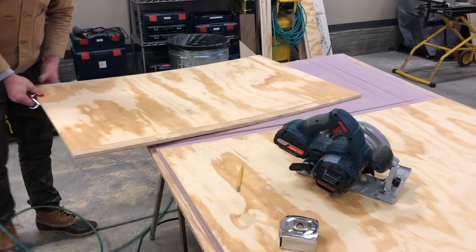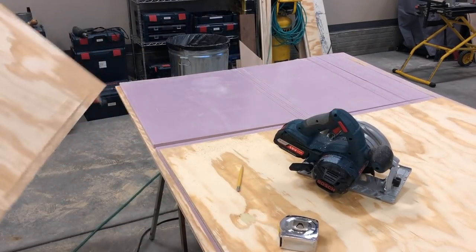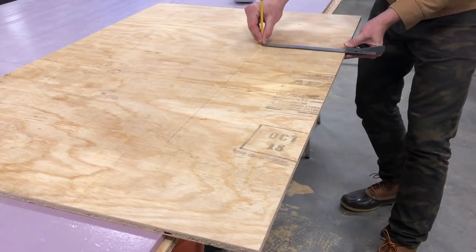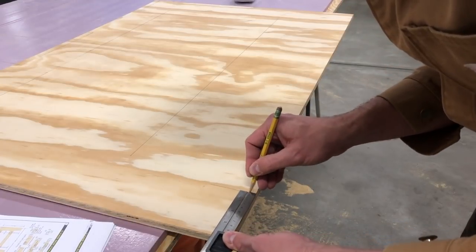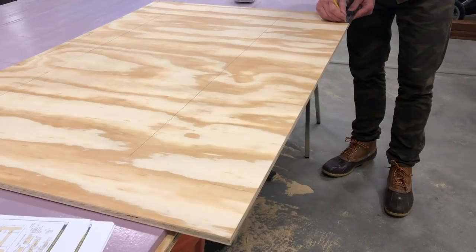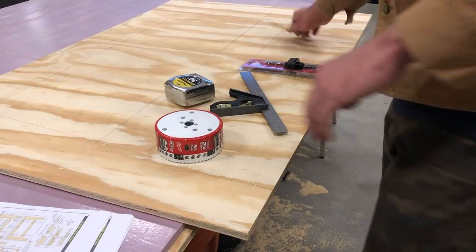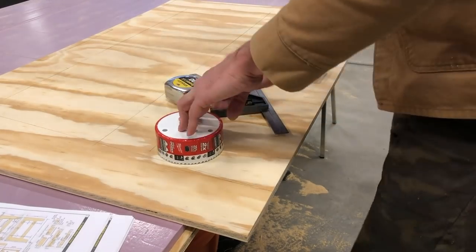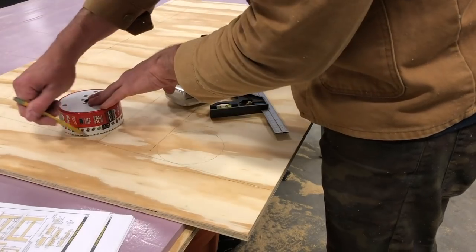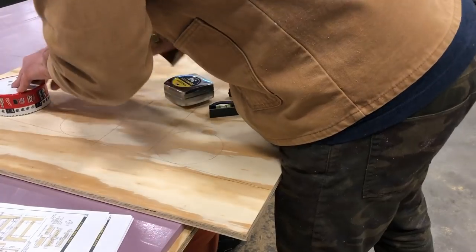Okay, cool. Now we're ready to do some detailing on the template that will be used to make the other sawhorse legs. I started by measuring the bottom of the sawhorses to get my general cut lines. By the way, all of these details are on the Paulk workbench plans. Now, those plans call for a 5-inch hole saw on these sawhorse radiuses, but I just decided to use a 4.5-inch since I'm already using that for the spacers, which I'll show you in the next video.